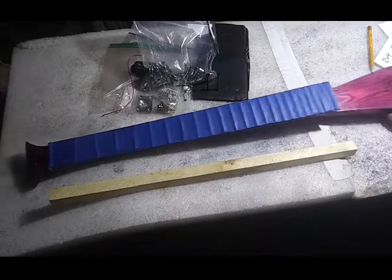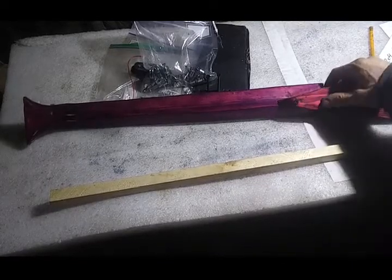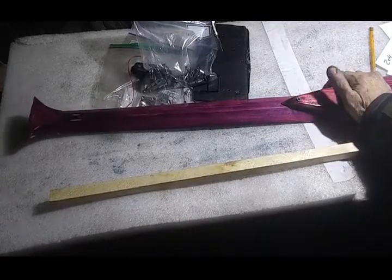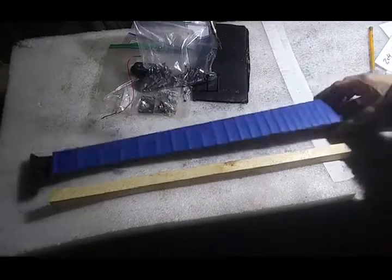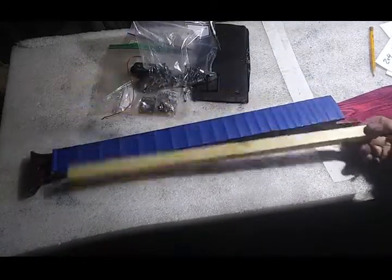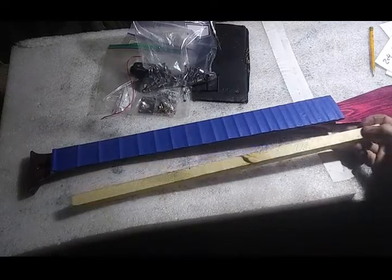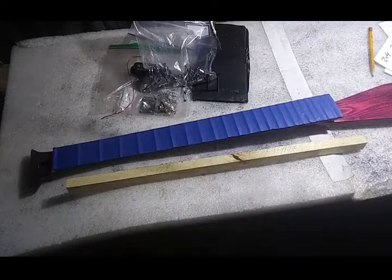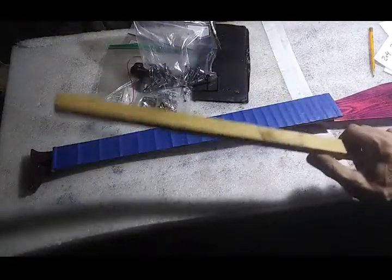You know, I was thinking about it, and if you end up having to chase all the holes after finishing, after the paint shop, then maybe just punch the holes, but don't drill them, and then send it through the paint shop, and then drill it once it gets out. That way you don't have to drill it twice, basically. Or maybe don't even worry about punching it, just cut it out, finish it, and then drill it once it comes out of the paint shop. Well, if you drill before paint, but you're having to chase it anyway, you're still taking a risk of tear out. Maybe just cut it, sand it, and then send it to the paint shop and then drill it when it comes out.